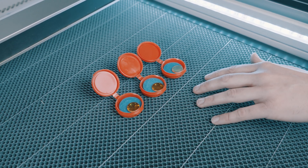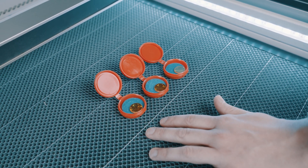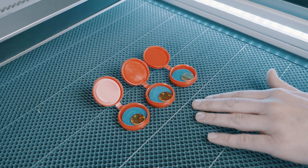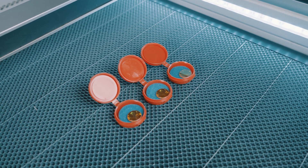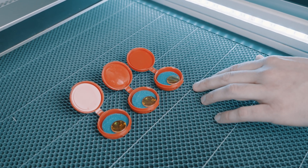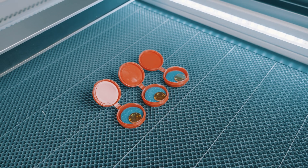All of these have a different purpose. On the 1.5 inch side, or the smaller side, they perform better at engraving. In the mid range — two inch, two and a half inch — those are good all around lenses. On the furthest distance end, a four inch lens is best for cutting. If you need any lenses, just contact us and we can help you out.